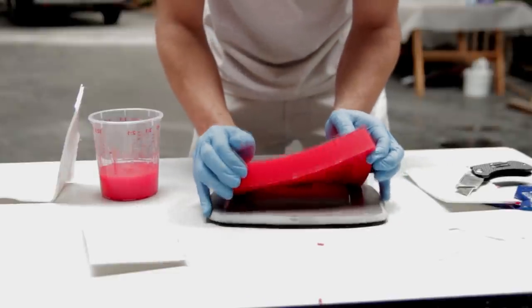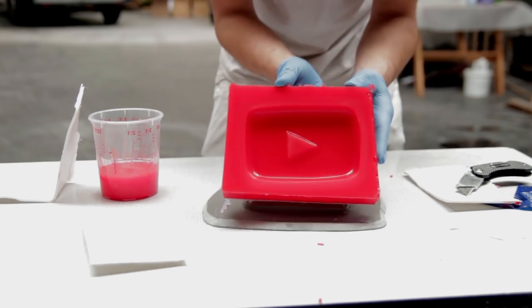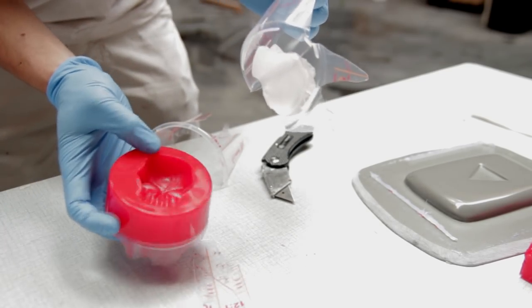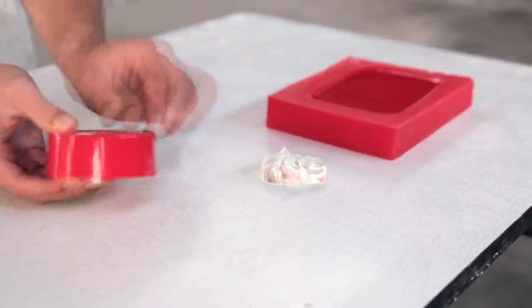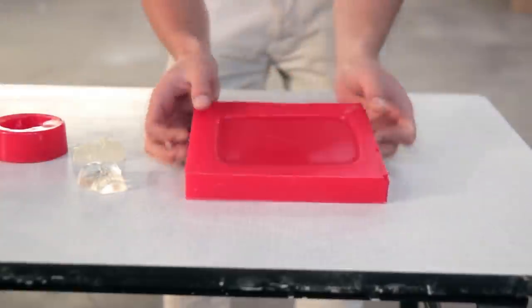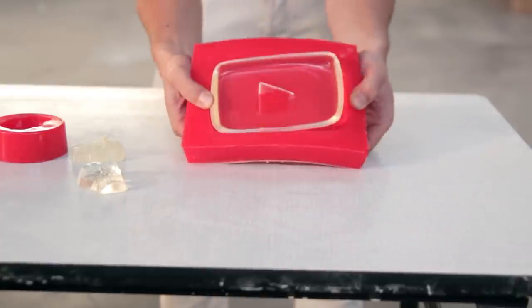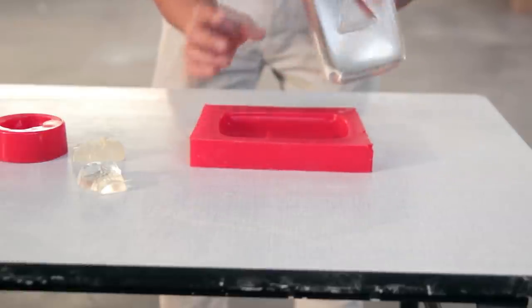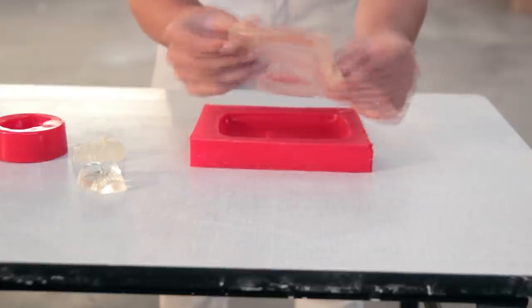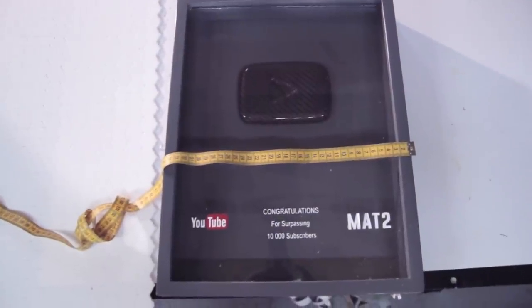So here's the demolding. No release was used because it's silicone, and silicone is self-releasing. So I'm getting a perfect silicone mold out of that part. And here's a second mold, so it's a little skeleton. If I have some leftovers from resin infusions from other projects, I use this mold just to have a skeleton instead of a cup filled with resin. So here I'm also removing the first part, and it will be clear later on why I did this first epoxy infusion resin part, just to know the volumes needed to cast that piece.